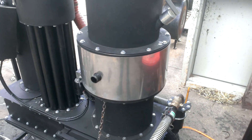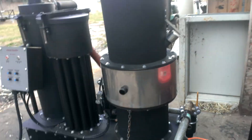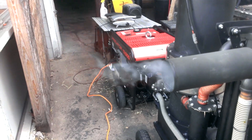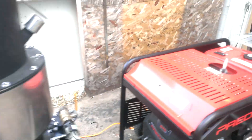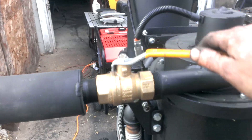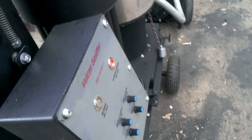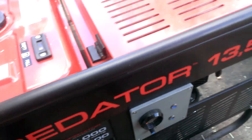We probably will be adding the removable jets as standard equipment as well. So I'm going to go ahead and try to light this. This thing is ready to go. Now to go to engine run, I'm going to switch the blower off. Don't ever just shut the blower off when you have it lit — always shut that first. I need to turn my automation system on — I have that on now. Transfer gas over to the generator and fire this up.